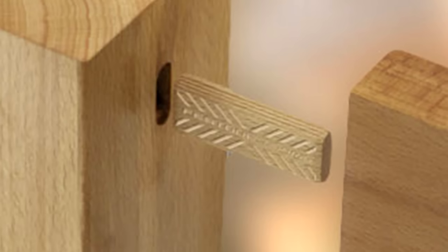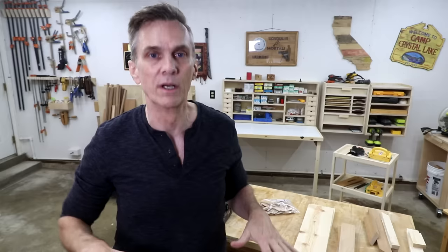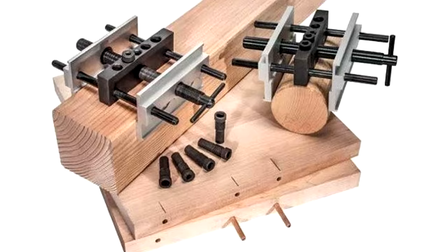What it does is it cuts deep holes into the wood that special dominoes, blocks of wood, are glued into. These are called floating tenons and are arguably just as strong as traditional mortise and tenon joints. These are great for professional woodworking environments, but its cost places it outside the mission of woodworking for mere mortals. A similar but weaker method is to use a dowel joining jig.